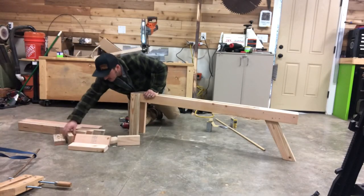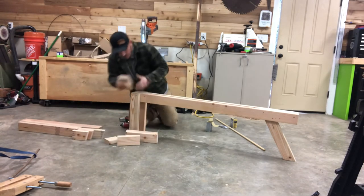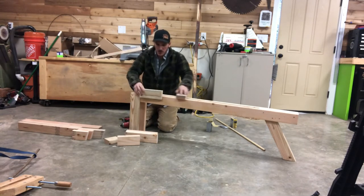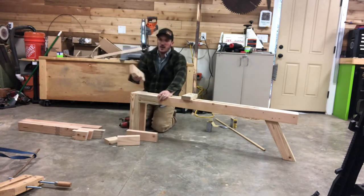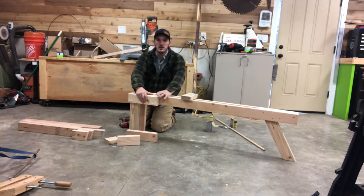So next up is going to be 2 8.5-inch pieces. Those 8.5-inch pieces make up part of the seat. So just double check, 8.5. Those are going to go in front of the back legs, to kind of give some structural support so those don't rotate. And then our 12-inch pieces that we cut are gonna laminate over the top of those. So let's go ahead and get those screwed in now, and then that will give us the base for our seat.